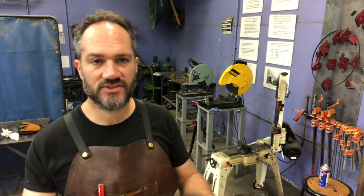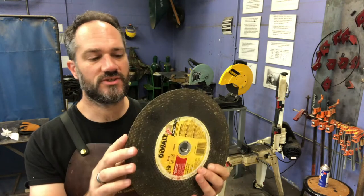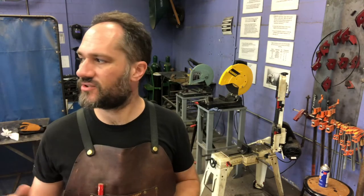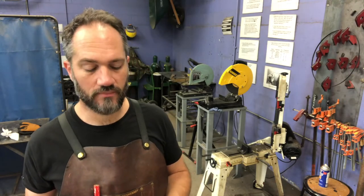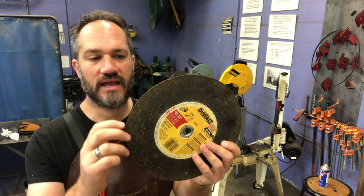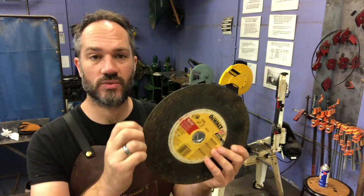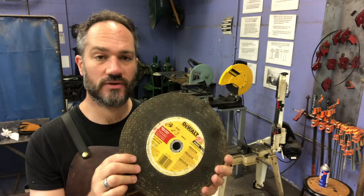Other than that, it works a lot like the chop saw. It doesn't have the fine adjustments that the chop saw has, but you can adjust it if you want to cut 45s. Now, a couple of interesting things: these abrasive cutoff wheels get smaller as you use them. You wear them away. It's not like a steel blade with teeth that you might find on a woodworking saw — these saws just grind the metal, and as the blade grinds the metal, the blade actually wears away too.